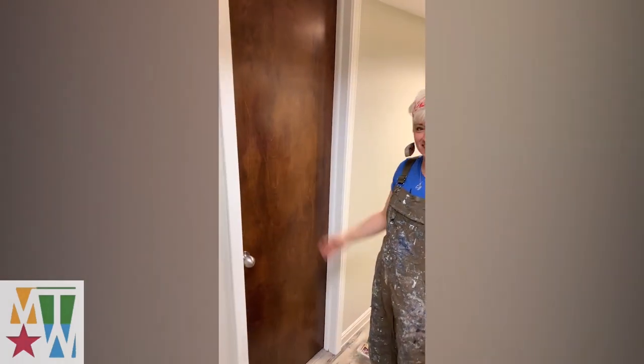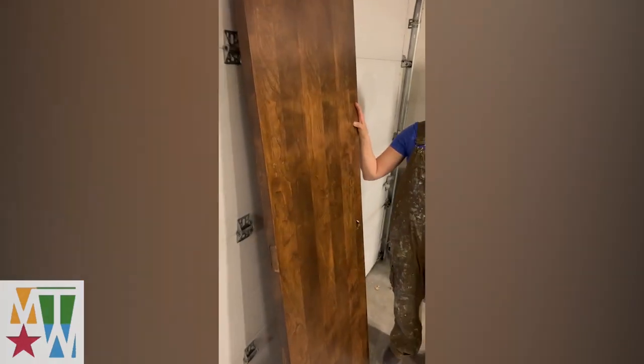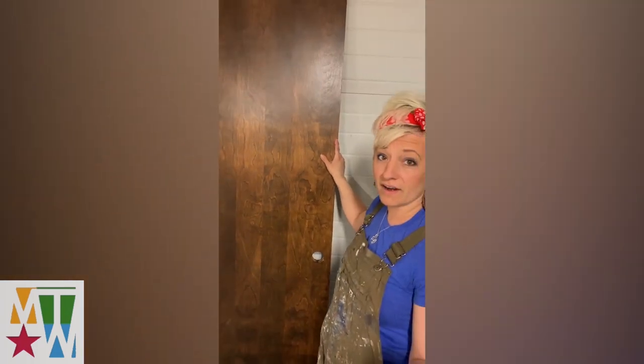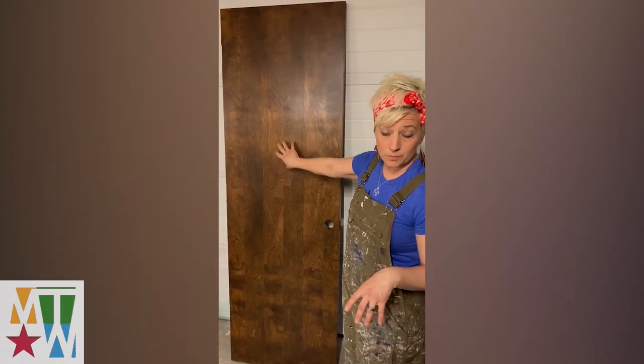Now it's time to take a look at our finished door installed — and here it is. It's looking brand new again. It's so beautiful; I need to renew all the doors in my house like this. We were able to do this in one day because I used water-based gel stain, which dries quickly, is very nice for the environment, and easy to work with. And because I sanded it and cleaned it, my water-based products will stick to this previously polyurethane door. Easy to do and very affordable. I'm Rachel Downs with Paintology and Music Theatre Wichita. Thank you for watching — more videos to follow.